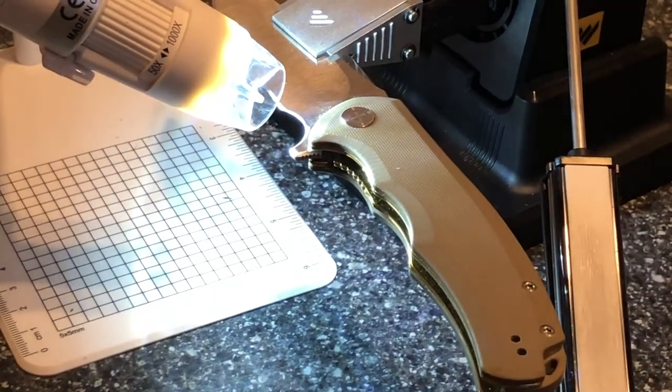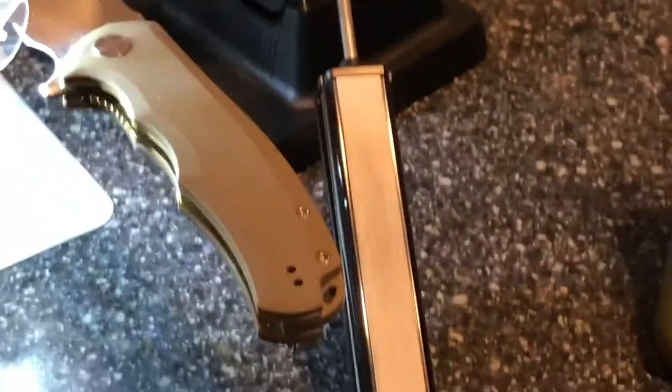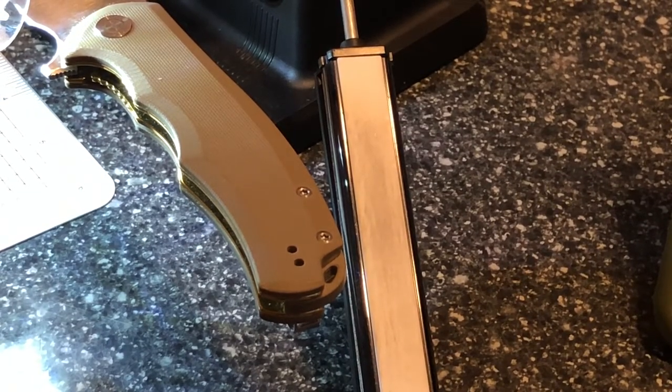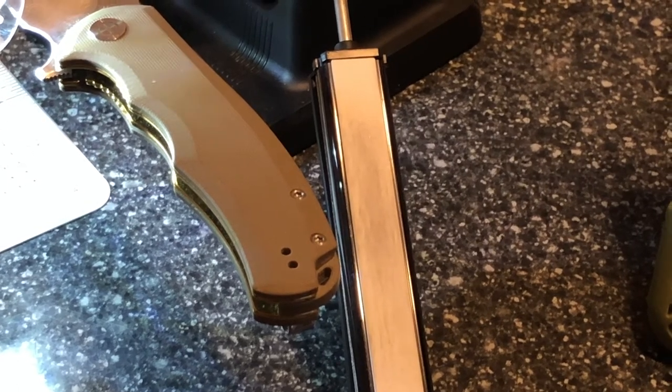So these steps, once you pass the grinding and the initial phase, the rest goes a little bit quicker. So ceramic, all that stuff, your angle's already set. All you need to do is refine those scratches, and that part goes a little bit quicker, guys. So right now, finished the white. So I'm gonna show you guys the edge right here on my little microscope. So let me just readjust here, click the contrast so you guys can see a little bit better.